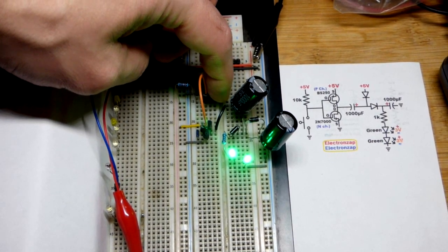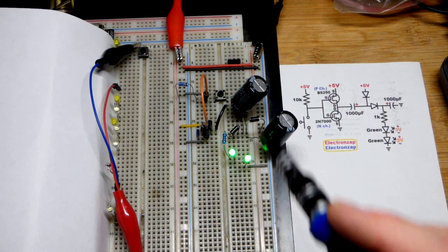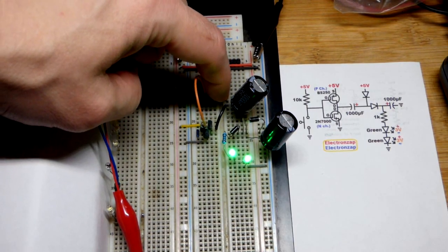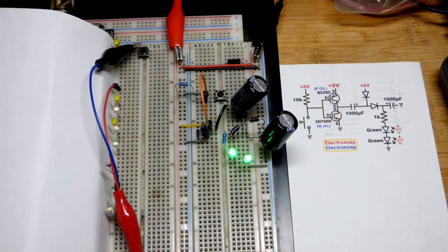For this particular setup, I would have to keep hitting the button constantly to keep them lit up. You wouldn't use a push button like this in a practical circuit — you could use the output of a 555 timer or something, far more effective. But this helps illustrate that I'm given a pulse of higher voltage so that the LEDs can light up.